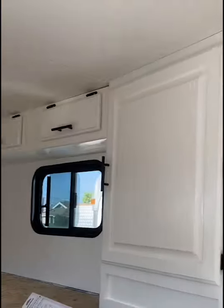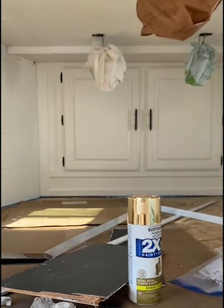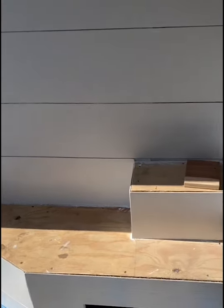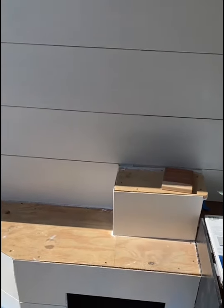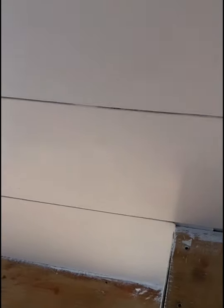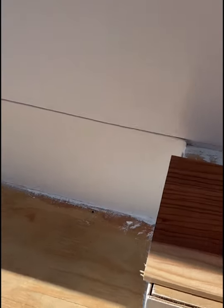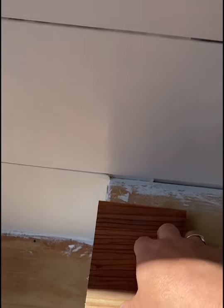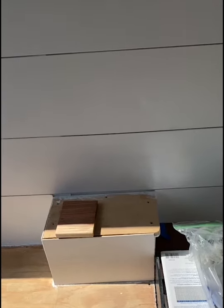I put a polyurethane clear coat on all of the shiplap and cabinets — gloss on the cabinets and satin on the shiplap. My husband wears a size 16 shoe so the steps are going to get scuffed up, and I might put another coat on just that area. For the steps, I was originally going to stain them, but I'm now thinking I want them to look uniform and love this red wood color — I just can't get that in a stain.